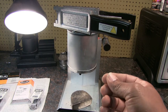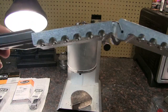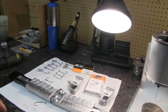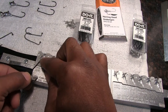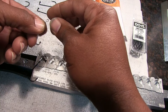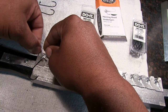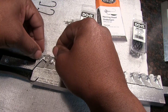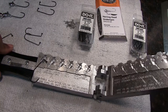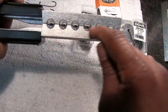Once we get this out, this mold is pretty warm right now but they've got nice wooden handles on it. Back over at the table, we're going to place the hook down in the spot that holds the hook, and we want to get one of the wires for the actual spinning blade - they've got a place right here where these wires go. With big hands this is kind of tedious, so make sure it's down in the groove good, the hook is down in the groove good, and we want to close this mold very carefully so the hook and wire don't jump out.